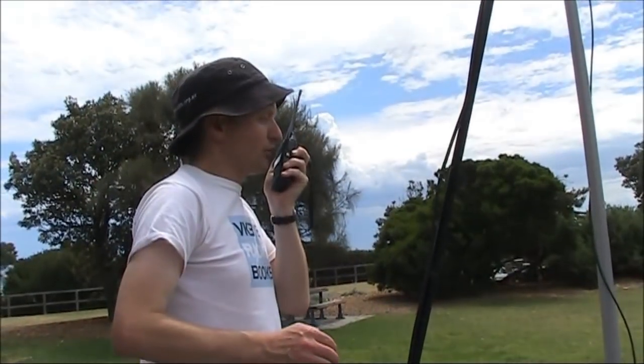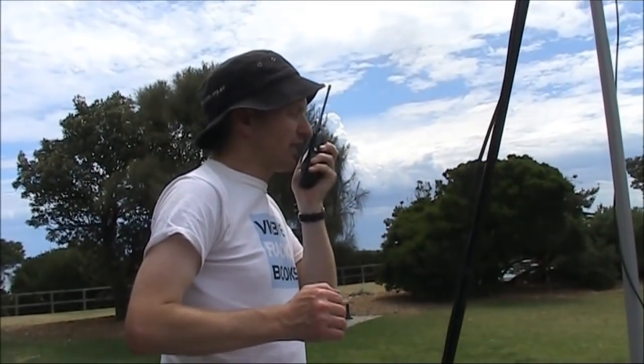What do you need to set up on amateur satellites? A couple of VHF/UHF handhelds. I say a couple because it's much easier to do it with two than one — that gives you the certainty of hearing your own signal going through the satellite and knowing how well you're getting into it, or if you're being swamped by other stations.